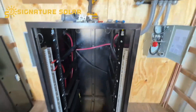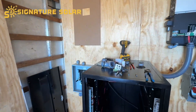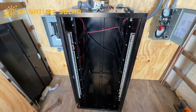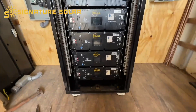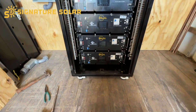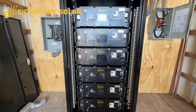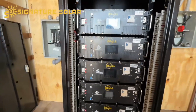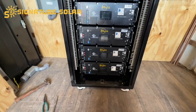Ground's done, everything's done. I'm going to go ahead and start sticking all the batteries in here, because I need that step stool to install the inverter. All the batteries are stuck in there now. The kit also comes with bolts for both sides of the batteries to make sure they won't come out of the rack, so I'm going to install those.